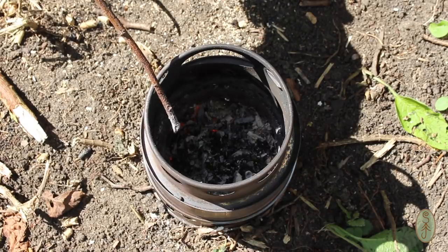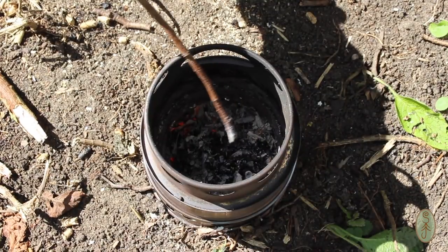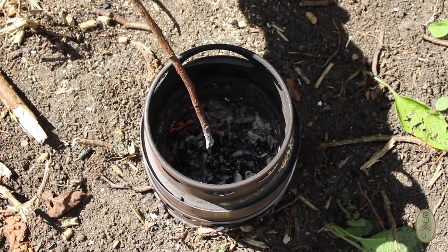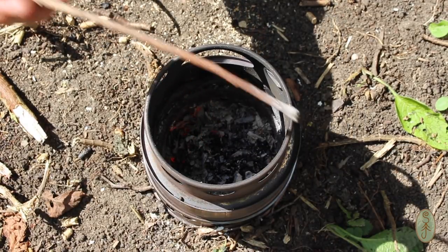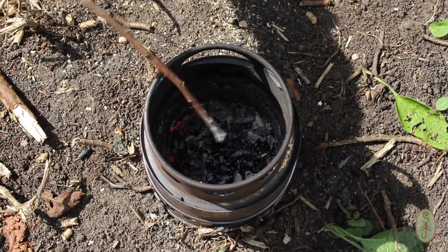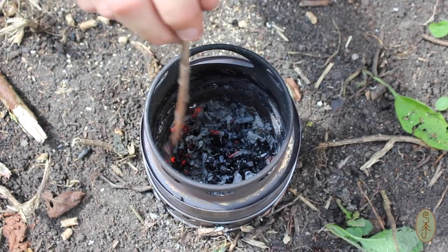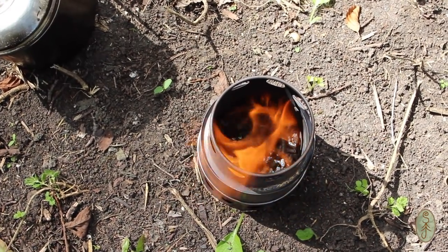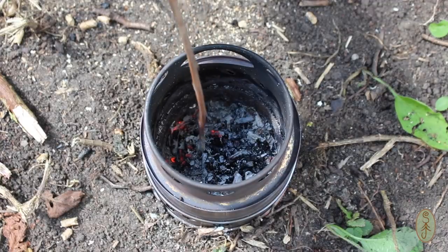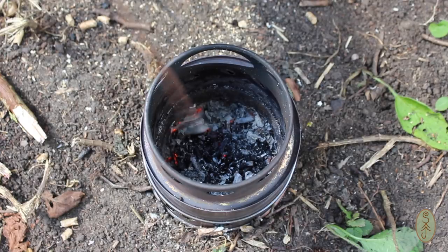And the really nice thing about them is that when they're up to temperature, and that wood gas is burning as well, you're getting a really complete burn, which is cleaner, but you're also getting more output for the same amount of fuel, rather than that gas just coming off the top of your fire and escaping and not being burnt. It's being kind of recycled really, and then brought out through these little holes in the outside and burnt on the top of the fire, which is why you get these little jets of flame which come out of these holes here. That's the wood gas which is burning on top of the flames that are burning beneath from the primary combustion of the fuel. It's a really good system. I'm impressed. I just need to tweak it a little bit.